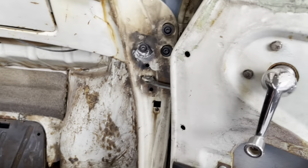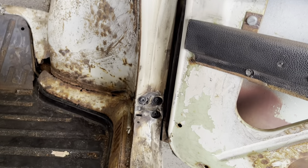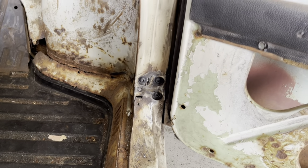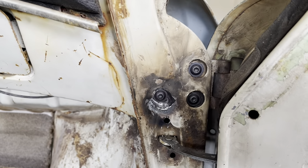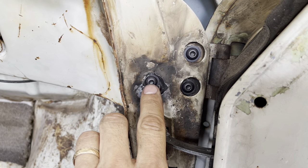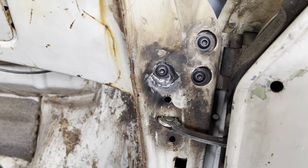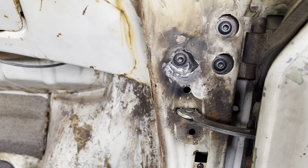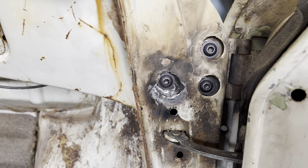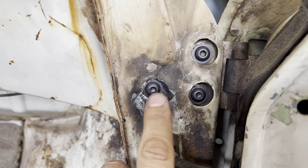At this point I just wanted to mention that basically what I was able to do was go ahead and put the door back in with the hinges, get all the screws that were still good screwed in, and then this guy of course was filled in. I was able to — mind you, before I put it in, I ground it flat, put it in here, marked it, drilled it, tapped it. So it's a little bit ugly there. I'd love to come back one day and make that a little bit prettier.